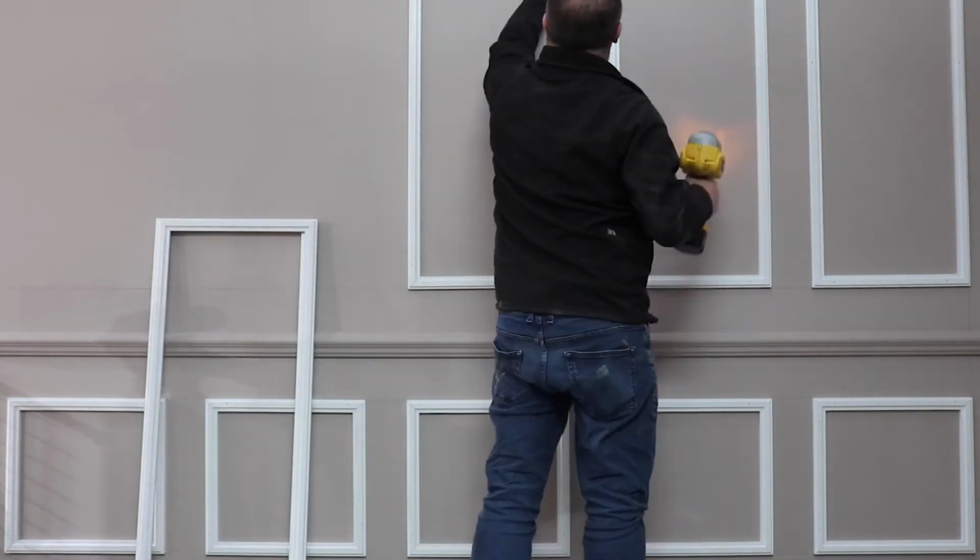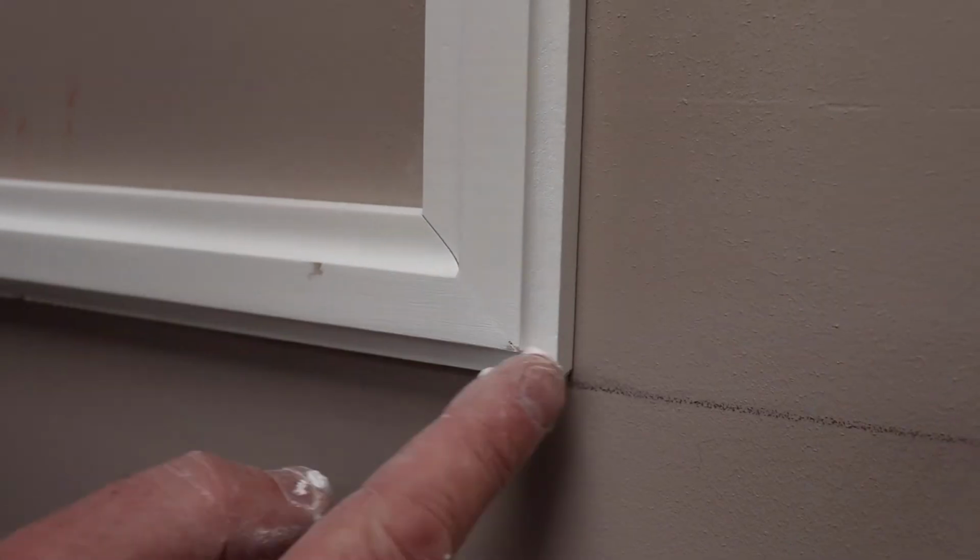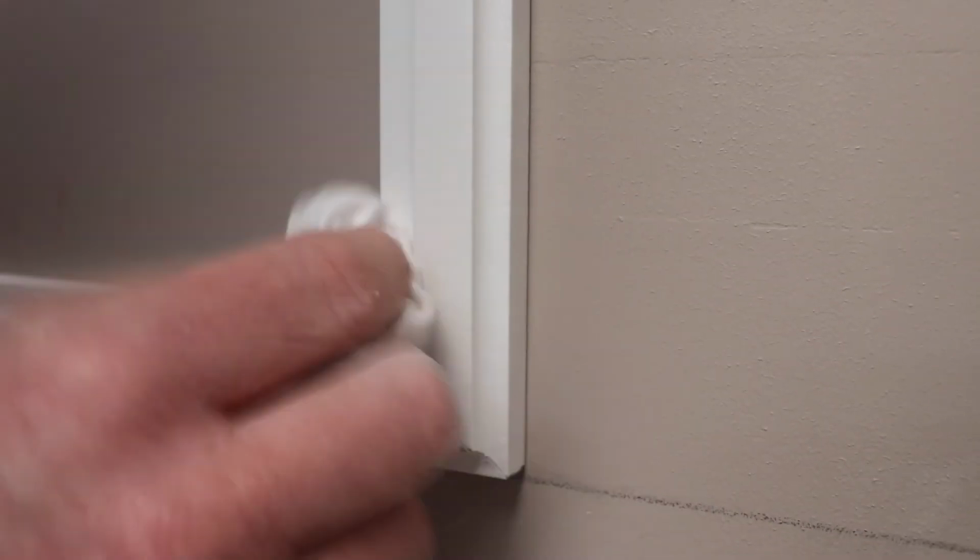Once your panels are fitted to the wall, you'll need to do some cosmetic work prior to painting. This includes filling any holes and mitres with filler and caulking the edges of the panels and dado rail. We would recommend using your finger or a wet cloth so that it rubs smoothly and sinks into your gaps nicely. And finally, sanding down the filler once it has dried. Check the instructions on the filler you'll use for the drying time.